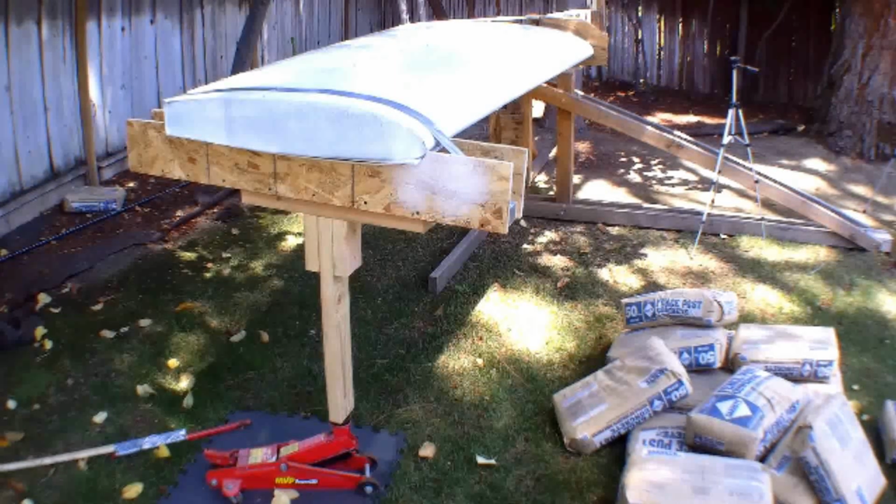So it is a compromise here, but the key part is to make sure that we get the root fittings loaded up properly and hope that the wing doesn't fail locally. And it all worked out okay. So a little bit of pad, distribute the loads, and we know that the wing, in terms of shear and local compressive loads, is much stronger than it needs to be.